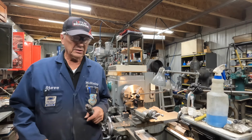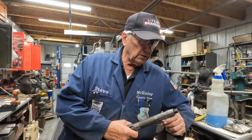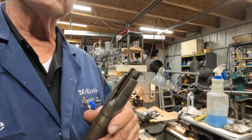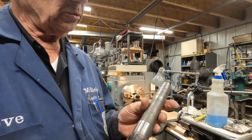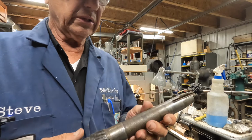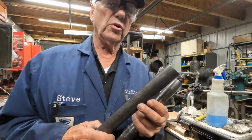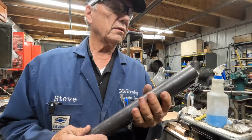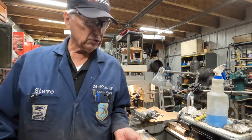The pinion gear is in the lathe right now, and I'm trying to reset up because I've used the lathe since I made the other part there. But you can see how this one, the keyway's been chowdered pretty good, and it's not in good shape at all. The rest of it is usable, but that got chewed up pretty bad. So we're going to duplicate this. I just got in a piece of 1 3/8 4130, and we're going to try and remachine our part here and do it again. So my first attempt was kind of a practice run, you might say.